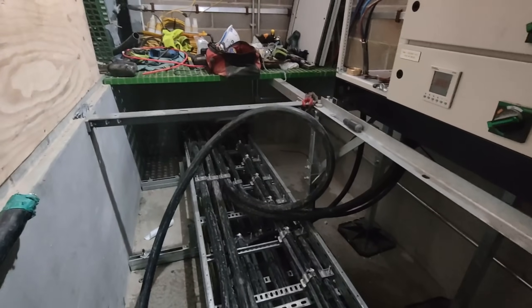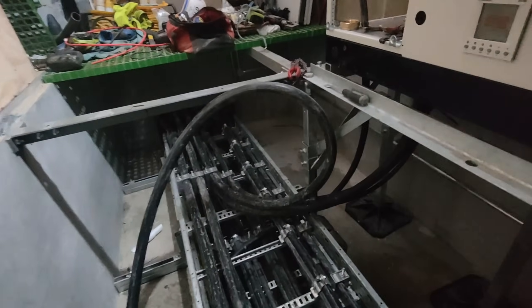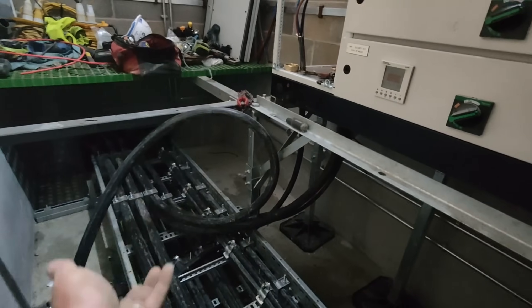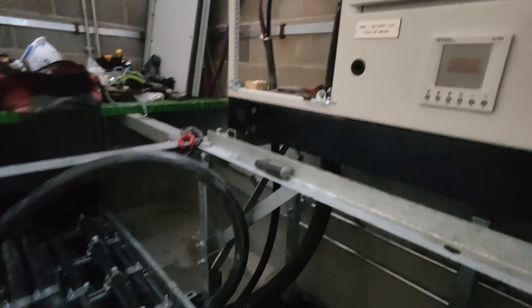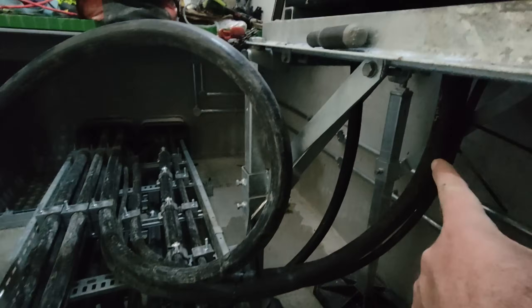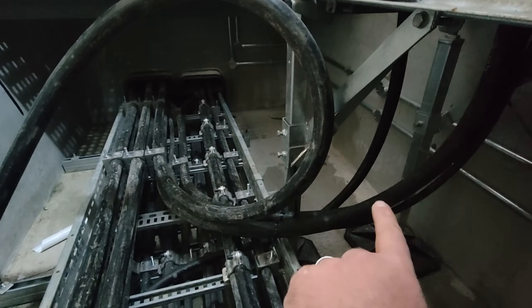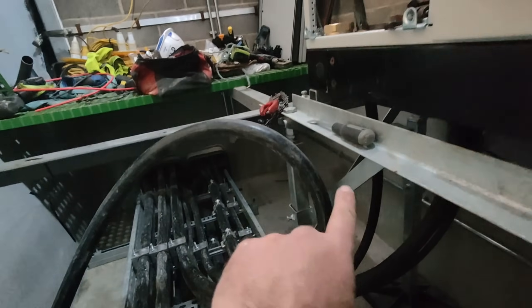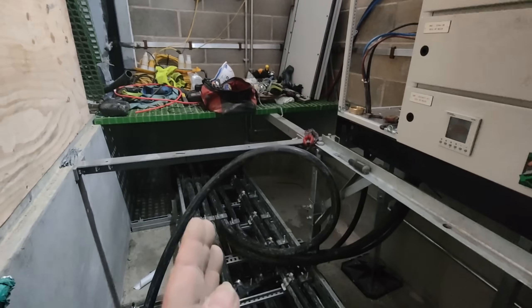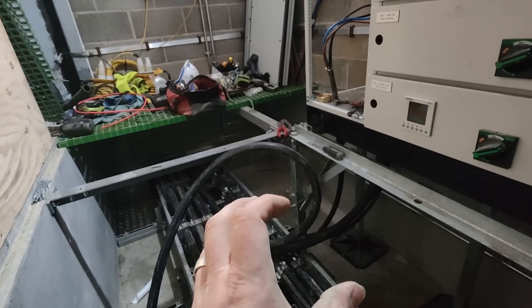It is proper warm. This one here with a big roll in it is the next one in. I've got to overextend it, really twist it over on itself. Then I'll put the gland in this time - no repeats. Let it run up and measure with the measuring cable over there, the red one, then bring the measuring cable back out, take it round the back, make a mark. But then I'm going to try and straighten the cable up so the armour ends twist round into the position it's going to finish in.